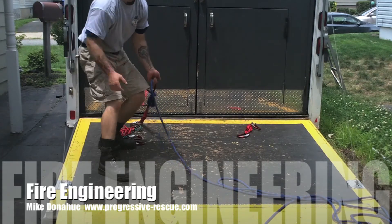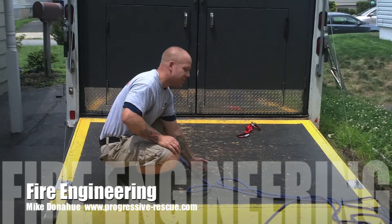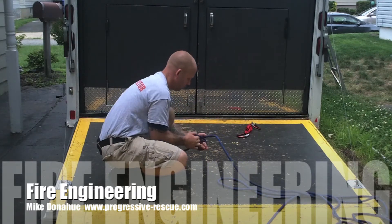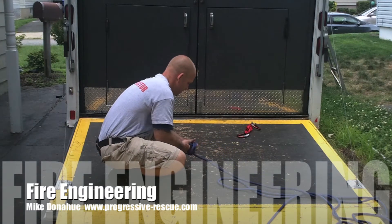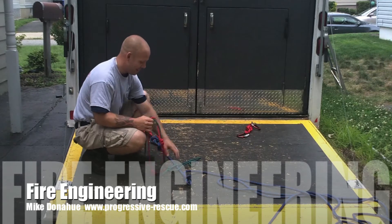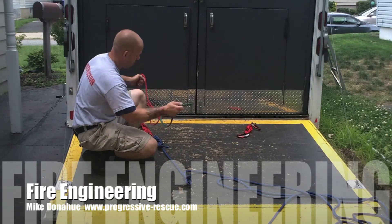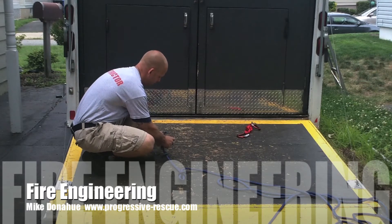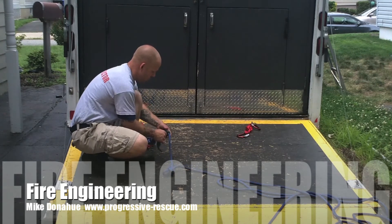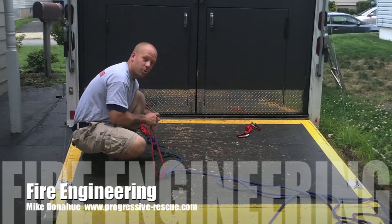So I have my first leg. What I want to do is bring it down to roughly the point where I want this angle to max out or stop. Right there, I'm going to go ahead and tie a butterfly — an easy mid-line knot. Now I'm going to add a pair of tandem prusiks as an easy method of adjusting both sides. You're just doing three wraps. Give it a pull. You want to flip these around, and you want them all to lay parallel — nothing crossing over. You want this hitch to load correctly on the rope.